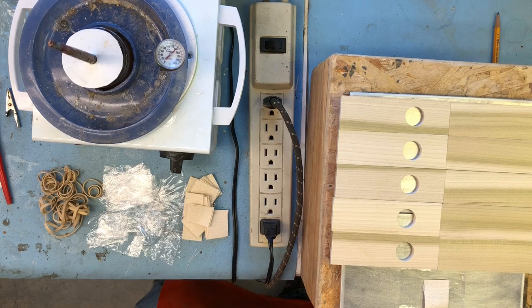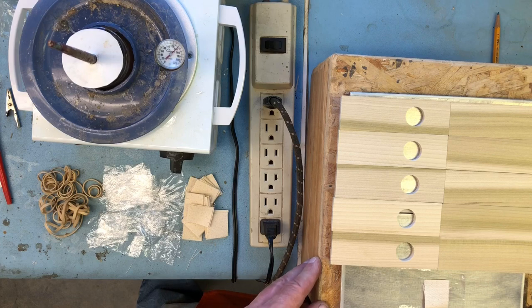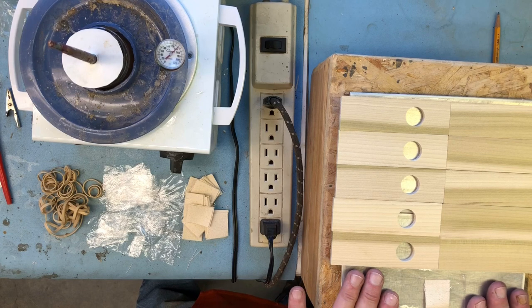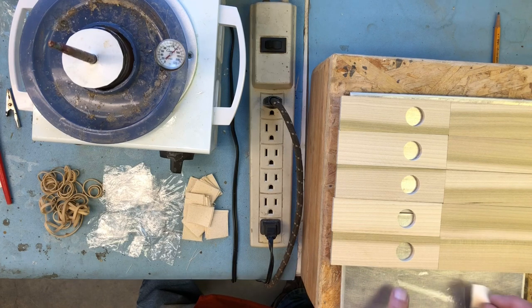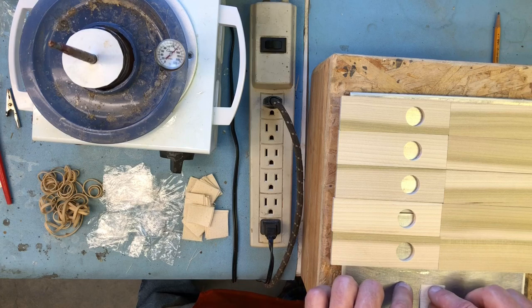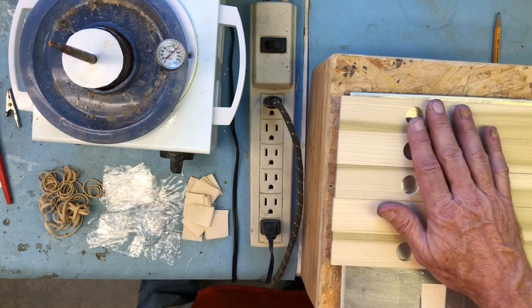Just to explain what we've got here: I've got an old iron mounted upside down so the bottom of the iron is facing up, sitting in a little cradle. I've got a couple pieces of aluminum sitting on top of the iron to give me a nice large flat surface. The iron is set to be warm — you can touch it for a few seconds without getting burned. And I've got a piece of plastic on here, it's about one mil poly plastic — these are those one gallon twist tie storage bags cut up into little squares. I've got the boards for my pneumatics here warming on the iron.